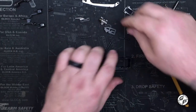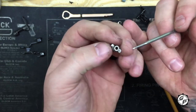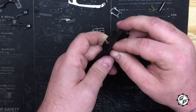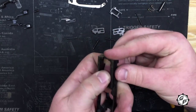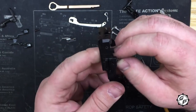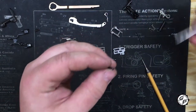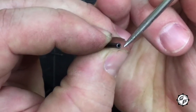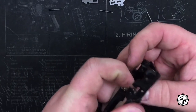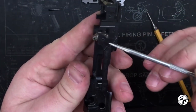Now we're going to put it back together. First thing we're going to do is put our secondary sear back in. When you put it in, you're going to have this small square piece facing forward. The spring is going to lay against the inside of the frame. Slide that on down in there. Now this is where it gets a little tricky — you're going to have to come in from the underside of it, the way it sits. This pin is the one you're going to use — you'll know it's the correct pin because you'll see a small hole in the end. It's going to look like a roll pin from the opposite side, but it's not a roll pin — this is a solid steel pin. You'll know you're completely seated when you're flush on the left side and you have the roll-pin-look piece sticking out the right.